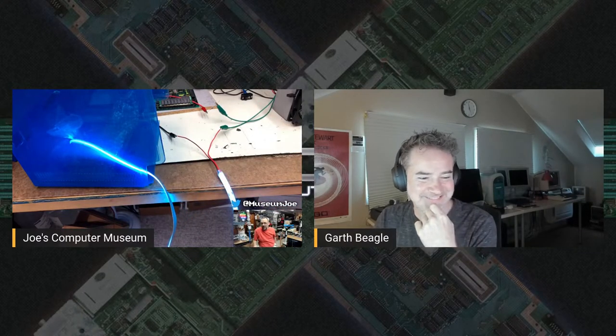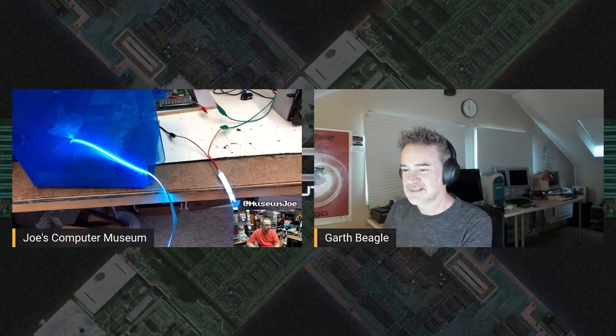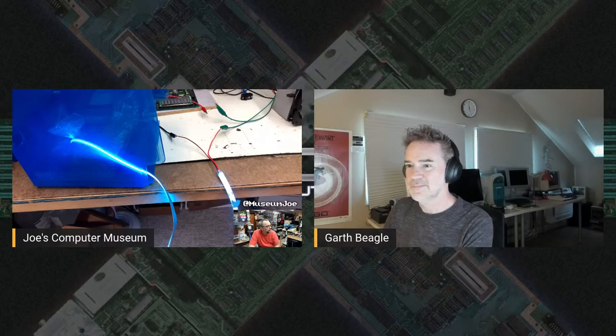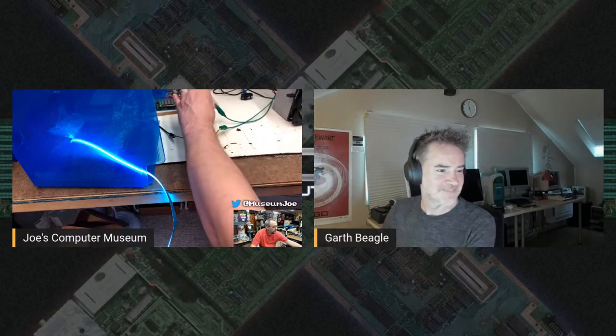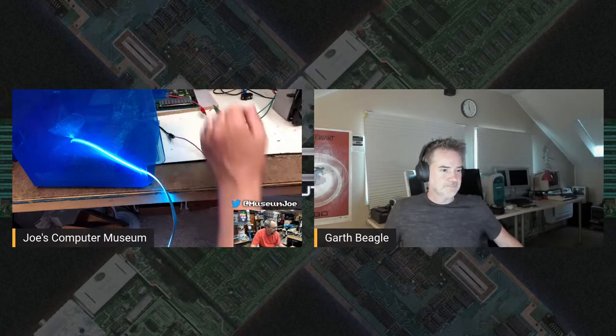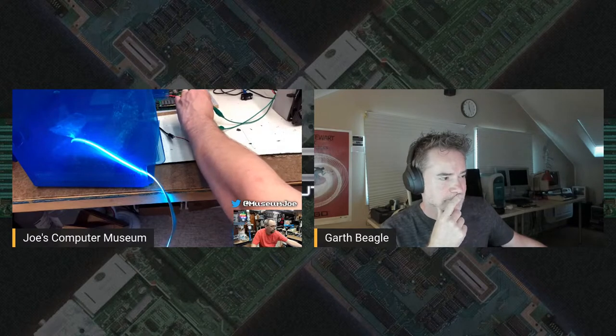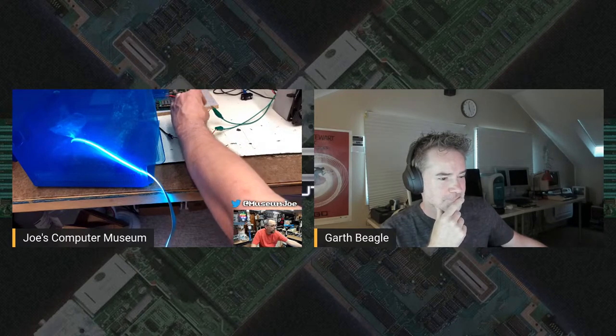Alex! Hi, Alex is TechLearn. Yes, 2 times 10 ohms in parallel. This is a quarter watt resistor carrying a current of 0.16 amps. So the resistor isn't even hot. It's not even warm. I'm not worried about it. The LEDs are getting warmer than the resistor is. I'm feeling more voltage through my fingers because everything in here is grounded than I am heat. So I'm not worried about it.